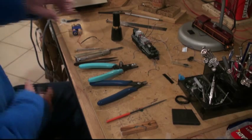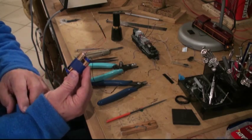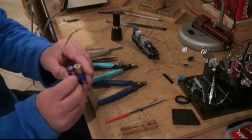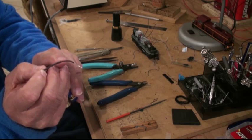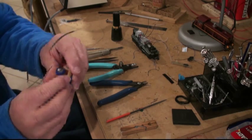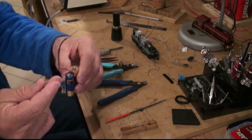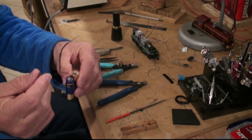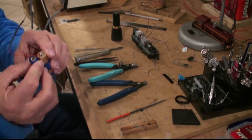One of the other tools I use is a 3-volt battery. It's just two batteries that I've put together, soldered some wires on, and this section, this lead up here, I've got a 1K resistor actually soldered into it so I can test LEDs, and it's actually soldered onto two needles, so small sewing needles that I can use to just poke onto the small LEDs to test them.